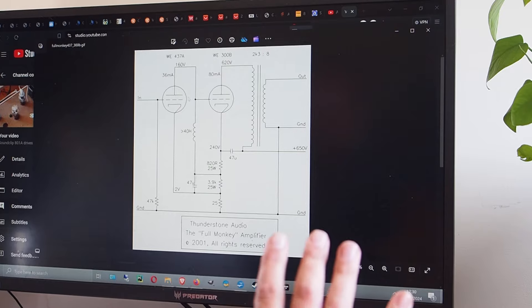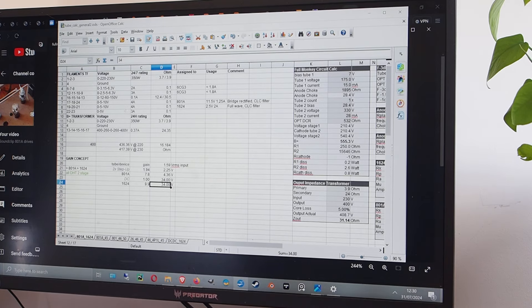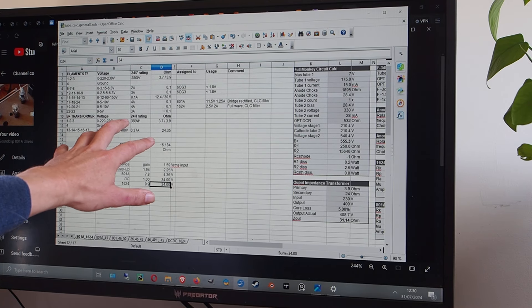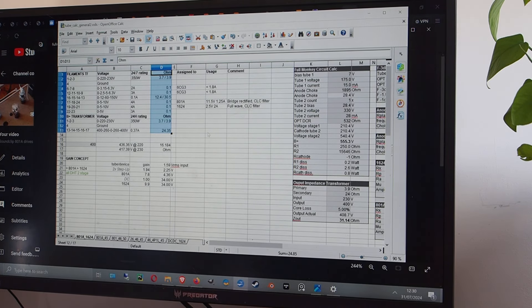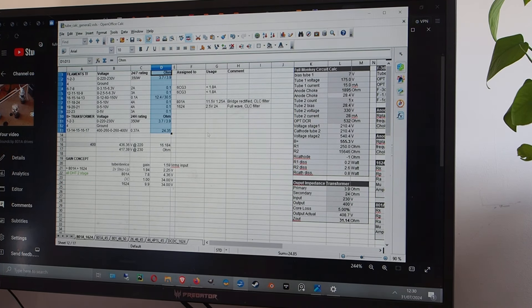The circuit offers very short AC return loops, simplicity, and a single B+ supply you can focus on making ripple-free. It's only two tubes. I started this amp to see if I could manage with two tubes, but ultimately the gain from two DHTs was not enough, so let me walk through the gain structure. When I start a new amp I plug values into a spreadsheet that maps transformer outputs to filament supplies and operating points, then calculates resistor values.